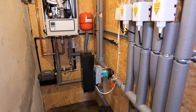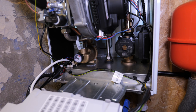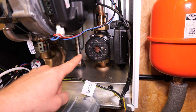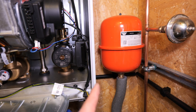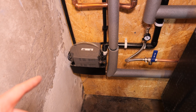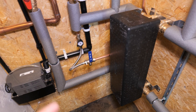We're pretty much wrapped up — pipework is now all insulated and we're just checking the final radiators. Let me show you inside this light commercial Vaillant boiler. It's 64 kilowatts and you're able to install it as a domestic gas installer. There's a big pressure gauge inside, a very good size pump, and it's essentially just a huge heat exchanger like you'd find in a standard Ecotech Plus — just made bigger. The one thing it lacks is an expansion vessel, so we've had to accommodate one on this small pressurized circuit, otherwise the PRV would give way.